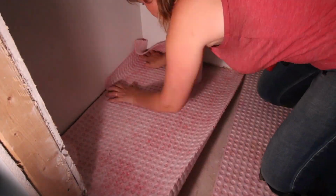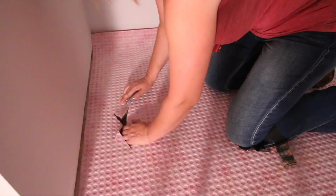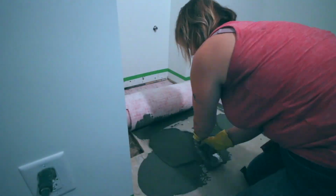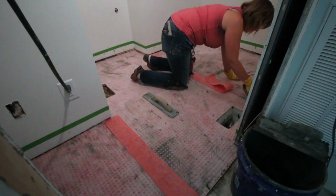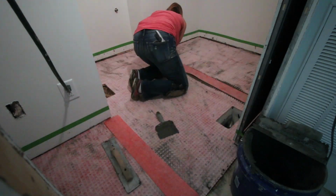Just like when you paint a room, you'll get the best results if you take the time to prep your space before you begin. Before laying tiles on your floor, you must put down a substrate to prevent future flexing that can lead to cracks in your grout or worse in your tiles. Typically, tile installers will use cement backer board, but because the cement tiles I'm using are so thick, I chose to use an uncoupling mat to reduce the finished floor thickness. Whichever substrate you use, be sure to follow the manufacturer's installation instructions carefully.